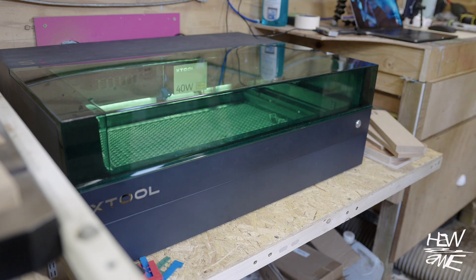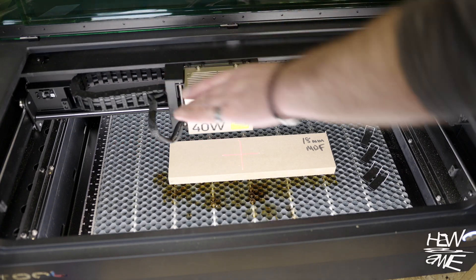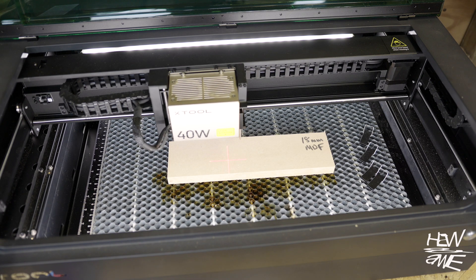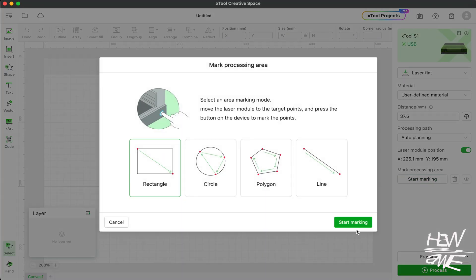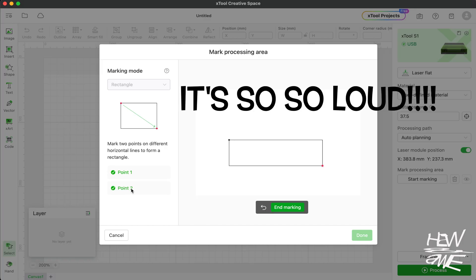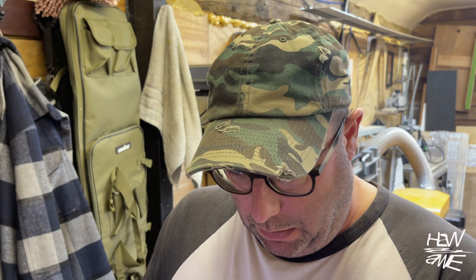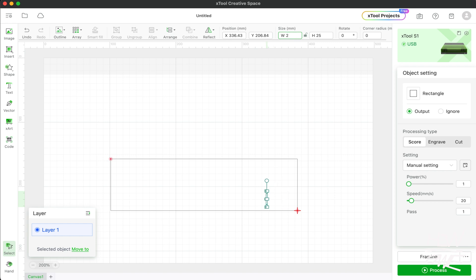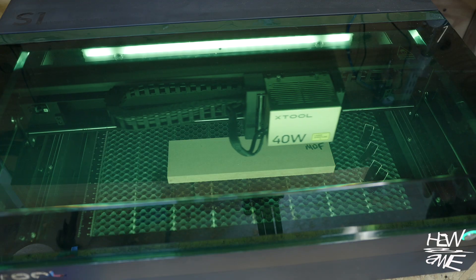Right, 18mm — I'm really not hopeful. Let's go through the usual shenanigans; I'm doing this so you can see me literally doing this without having tried it first. Let's get a thickness measurement to sort it out. I managed to turn off that annoying bleeping sound — every time you press that button it doesn't bleep anymore, which is lovely. Let's add a rectangle, make it 25 by 25mm, power 100, speed as slow as possible. Process start — now we wait.